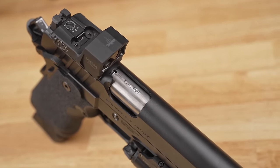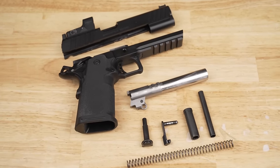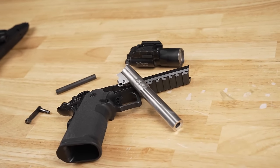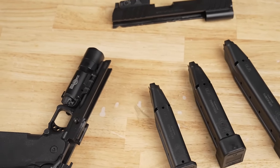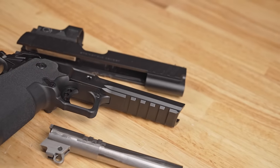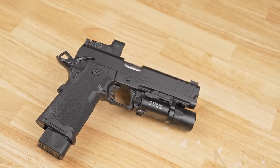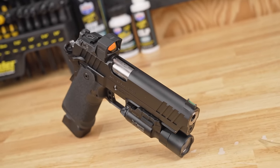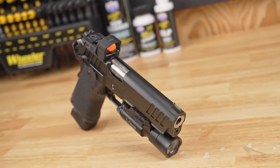Let's take a good look at the wear and tear on the Prodigy, starting with the barrel surface. You're going to see all the basic normal barrel wear for a 1911 or 2011 pistol — across the hood, across the other contact areas out front, down the side. The frame rails are showing the same basic coating wear I would expect at this point: no gouging, nothing that gives any concern. The Cerakote finish on the frame and slide aren't really showing a ton of wear at this time, but as holster work continues, the Cerakote will begin to show wear on the sides of the slide and toward the front of the muzzle over time.